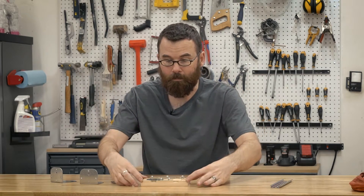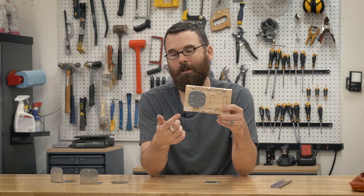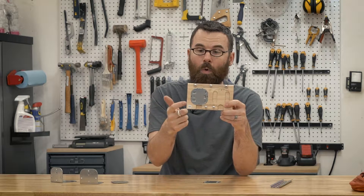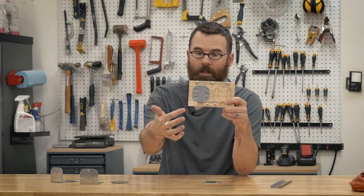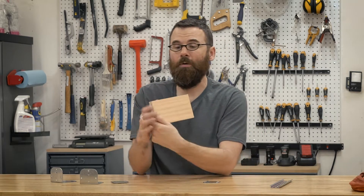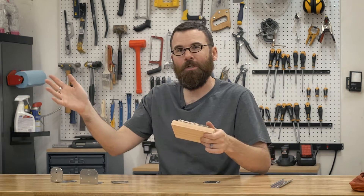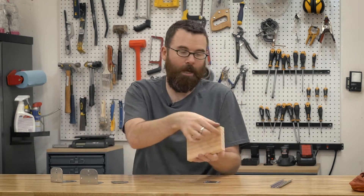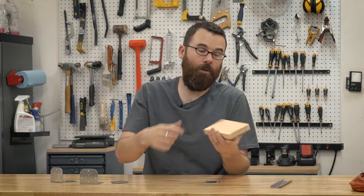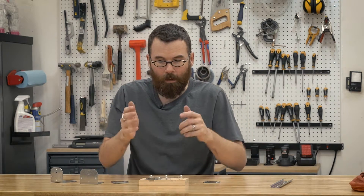This piece was all designed in SOLIDWORKS. Once the piece was designed, I have a zero-zero reference down here at the bottom. I'm using my little label maker to indicate the zero coordinates — zero, zero, and then the top of it is zero — which makes it really easy to indicate. Sometimes I also put a label on the back for the program name in my machine. I have a special folder for E-Gauge System stuff, and I put the CAM name on the back so I remember which program it is. That's really all there is to it. Let me show some video of this being made and then I'll show you how it works.